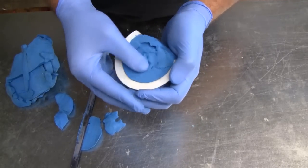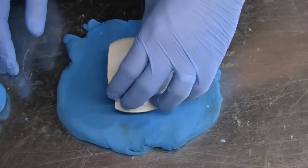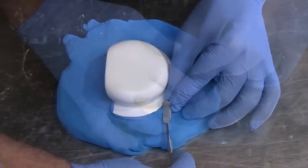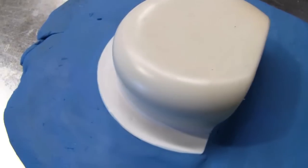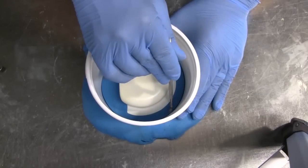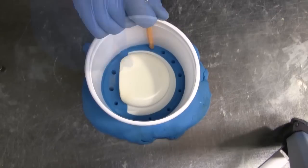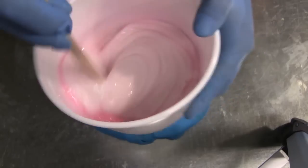Once the back cavity has been filled, we're going to join it with about a half an inch of synthetic clay as a base. The base, along with the clay packed in the back of the vent, will act as the first side of the mold while we pour the second half. Once the vent is secured to the base of synthetic clay, we can go ahead and add a mold box — in this instance, a container with the bottom cut off, pressed down into the clay to create a reservoir to contain the silicone. A clay tool is used to smooth the clay to the inside of the container to prevent silicone from seeping down the side. A pencil is also used to place holes as locators into the clay so the two halves of the silicone will locate nicely together.